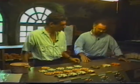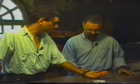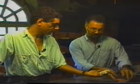Okay, we're in the hand painting room. Is that what we would call this? Yeah. I know you've gotten some tiles out here to show us. Why don't you take us through the process? When we start out with a piece, we'll press it out of a mold, and we'll have a terracotta piece that we allow to dry. And then once it's dried, we'll fire it. That first firing we call a bisque firing. It will come out this sort of terracotta color. It's hard. And at that point, we'll start applying a glaze onto the piece.